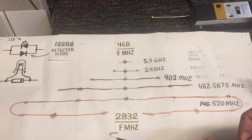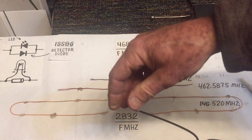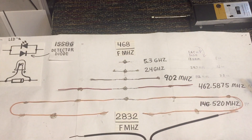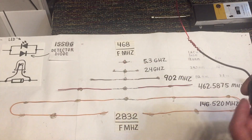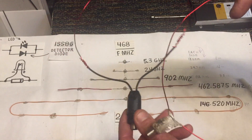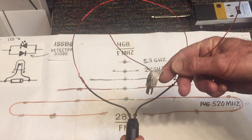Something like this — I don't know what frequency this would be resonant at. The only reason it has loops on the end is just because it came that way; I don't have to have them looped up. Another antenna that works quite well is a loop antenna like this — believe it or not, this is a pretty decent antenna. Having a balun on the end here works pretty good too, whereas this one doesn't have a balun.